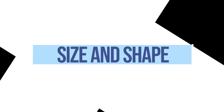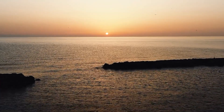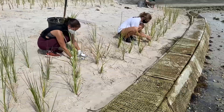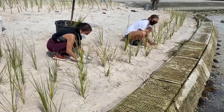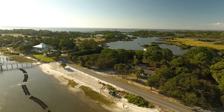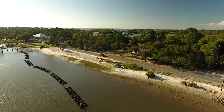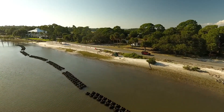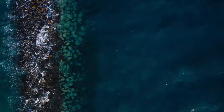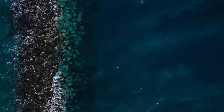Now let's cover some basic details about the size and shape of breakwaters. The difference between a project being considered a breakwater versus a sill or edging project has to do with the height, but also the placement of the material. Breakwaters are generally taller and placed offshore of the vegetation elements, while sills tend to be lower profile and placed right at the edge of the vegetation. Decisions about length and height will impact permitting options. If the breakwater will be more than 500 linear feet long, or if it will be above the water at mean high tide, this will trigger more restrictive permitting, but this may be necessary for large properties or higher energy sites. While taller is not necessarily always better in terms of habitat enhancement, taller breakwaters will provide more protection against waves and wind energy during higher water. Research shows that a breakwater must be at least 60% of the total water depth to be able to influence the incoming energy.